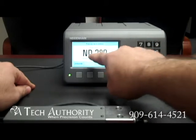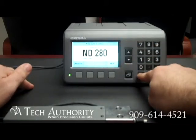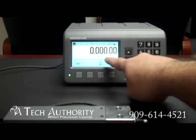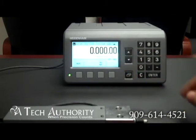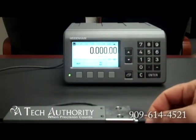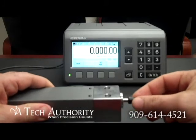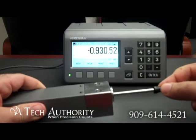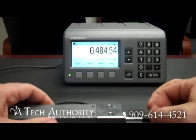It says the power was off — press any key to continue. I'll press clear to continue and here's the display. You'll notice that it says reference mark evaluation on X1; it's actually asking me to cross the reference point. You can see here I'm moving my gauge and it's not actually doing anything until I pull it far enough that it crosses the reference mark — and there it starts counting.